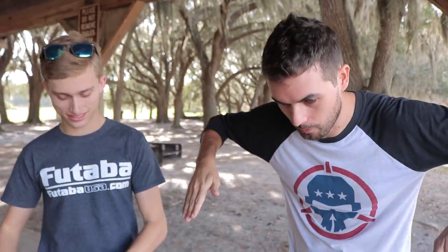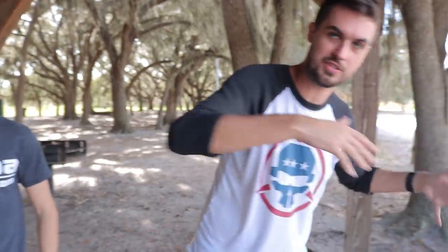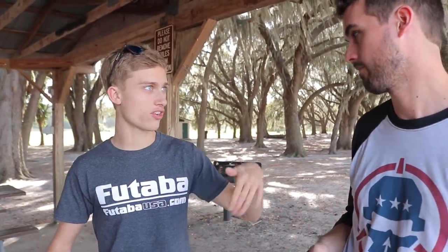So normally when we fly these drones, we put the drone at an angle and it stays at that angle. So with this drone, if you want to turn your pitch forward, you need to both yaw and roll to accomplish a right turn. Not gonna be able to do that with limited amount of input, so we're gonna use an auto level. Turn like this, yeah, this is fun. So if you use an auto level, then all you have to do is be flying forward, and as you yaw, the drone will compensate roll for you.